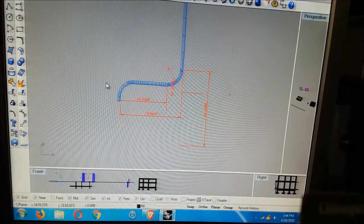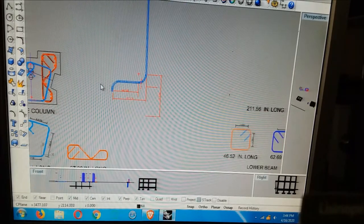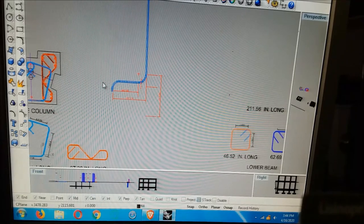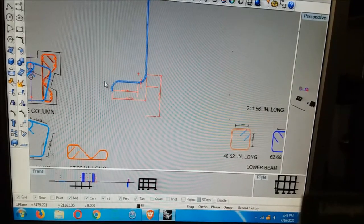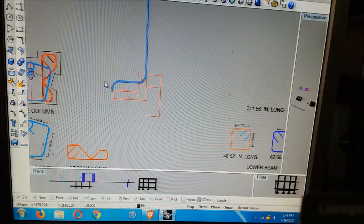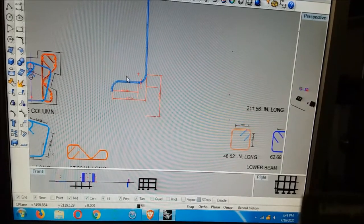Actually, before these things were put in the hole, there's a rectangular grid like you see on everybody else's Philippine house. About 8 inches by 8 inches, number 12 bars. And it's 6 feet by 6 feet. That's 5.5 feet by 5.5 feet because there's cover around the ends of the bars in the concrete. And we didn't make them different sizes for different size pads because they only had to be 2 meters square to be way up in the safety factor range. So that was tied under the bottom of this before they were tilted up.